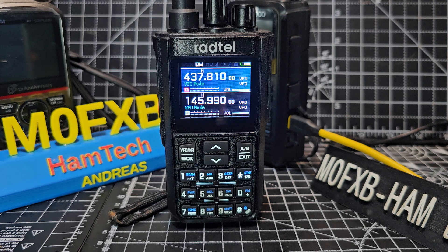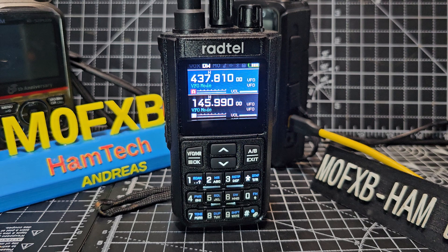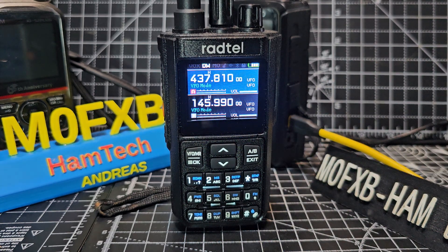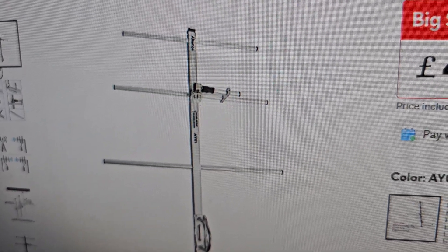You really need to get outside, because when you try to reply to it or even hear it, you're going to need really a Yagi. Although I have been out before a couple of times - as long as you get out and up high and move the antenna around a little bit, you can pick it up as it's going away or towards you. But you do really need a Yagi - you can buy these quite inexpensively these days for a two-meter Yagi, which is a directional antenna. You can make them too; they look a bit like a TV antenna.